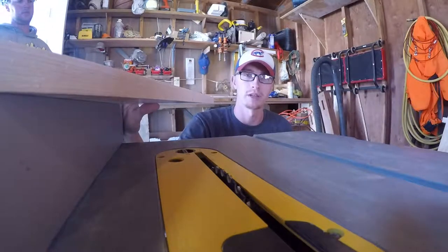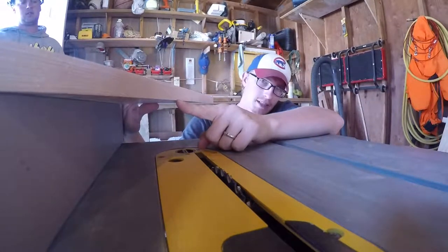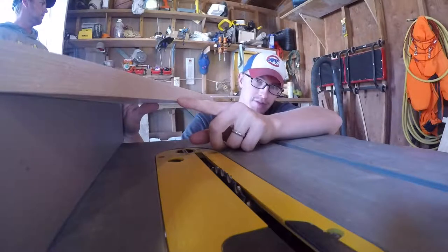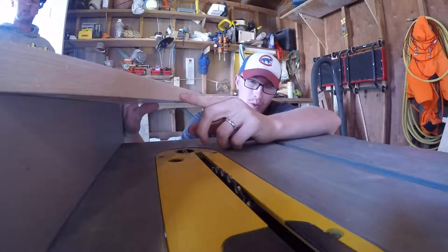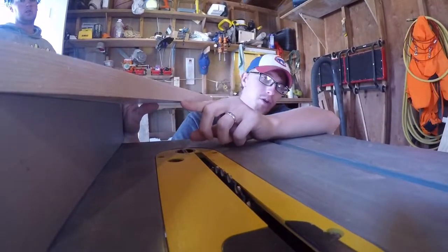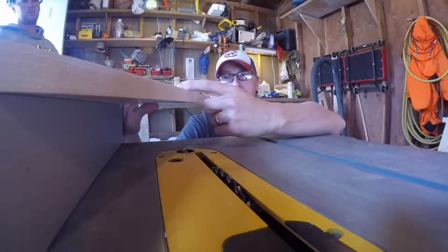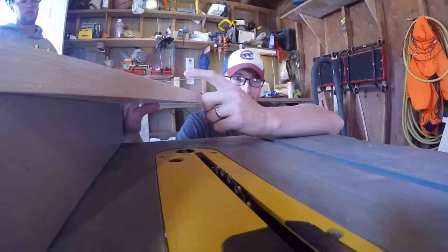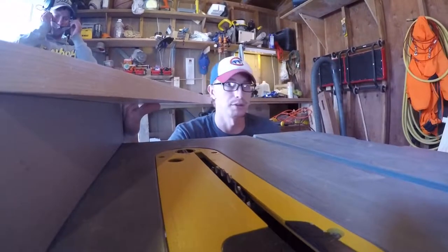So this is how we're going to be doing the tongue and groove. I've got the table saw set up now. We're going to take out one quarter of an inch deep out of each board for the tongue, and it's going to be one quarter of an inch wide — that's what the tongue is actually going to be. So there'll be a quarter inch away, quarter inch left, quarter inch away, and they're going to be slotted in one half of an inch. So it'll be a decent-sized tongue and groove, and hopefully none of them break off, but I think we should be just fine since there are other things supporting it as well.